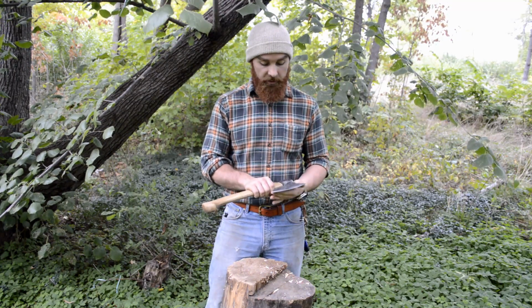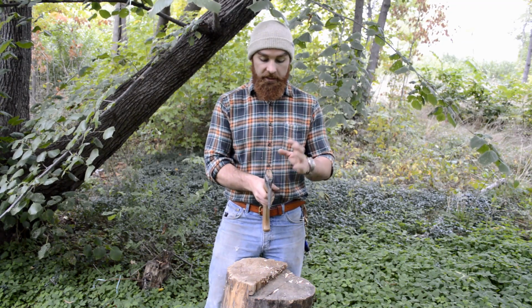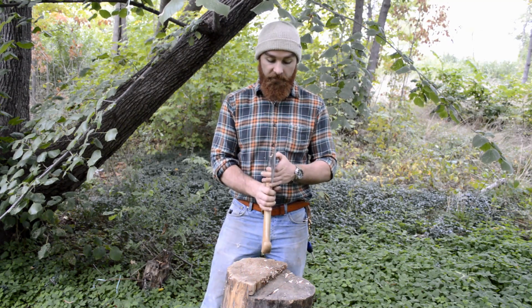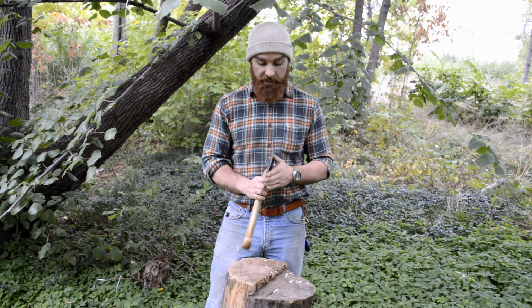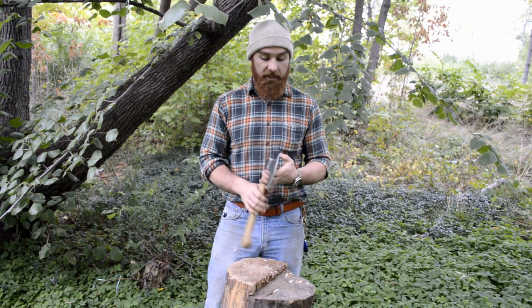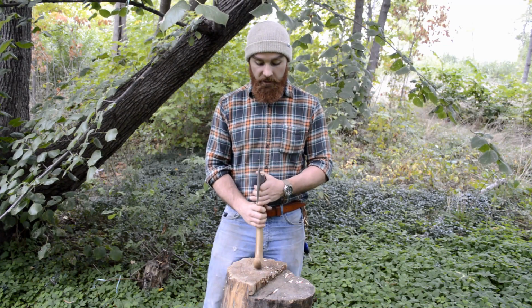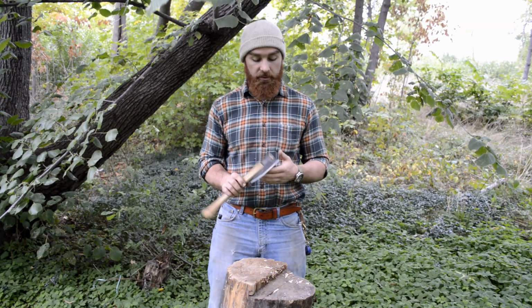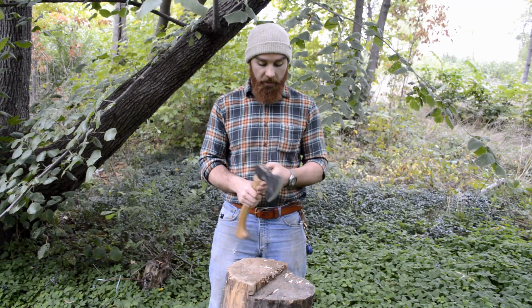We have quite a long beard on this axe and a long cutting edge. The profile is not exactly thick, but it has quite a heavy eye and poll that slims down and tapers very nicely into the bit, which is followed in this case by about a 32-degree bevel. I've worked with the bevels a little bit, so when they came they were quite convex and a little bit steeper, but I've just altered them slightly. With all of the axes that I get from Hans Peter, after I test them, and like Jeff here at Noble Woodcraft tests them, we do our own little modifications on them, and I like our carving axes at about a 30-32 degree angle for the bevels. It has quite a lot of punch to it.